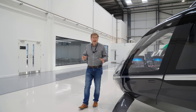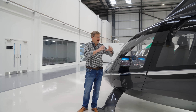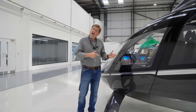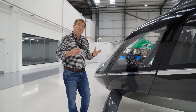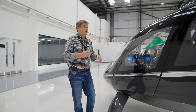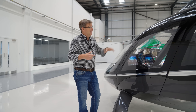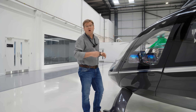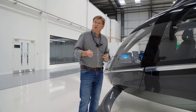The HX-50 is a very big five-seat helicopter with lots of glazing, so you get an amazing view and a nice big door so entry and egress is simple for everybody. The downside is that the glazing and the doors themselves represent quite a significant proportion of the empty structural weight of the aircraft. During the development of the Gen 2 fuselage we've expended a lot of effort getting the structural weight of the doors — for both the front, the back, and the cargo doors — down to the absolute minimum with a really efficient structural recipe.